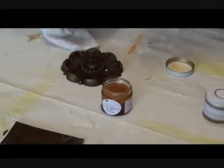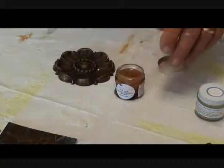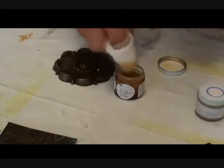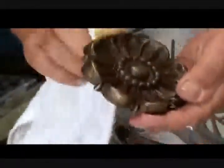Now, I know with a lot of the products you have to shake or stir them before using. Same thing with the oil? Yes, the oil, because I have a lot of different things in the oil, so I definitely want to shake it. You want to, again, put on a very, very thin coat. Just enough to make it look wet? Yeah, just enough to make it look wet. Again, this is the same sort of thing where you'd want to put on more than 1 coat.